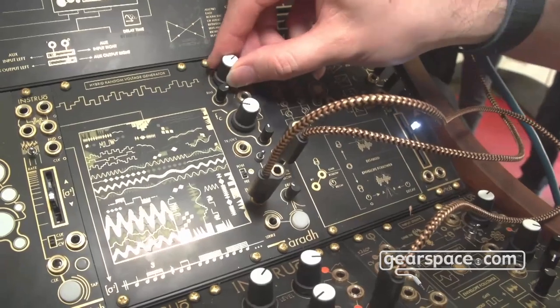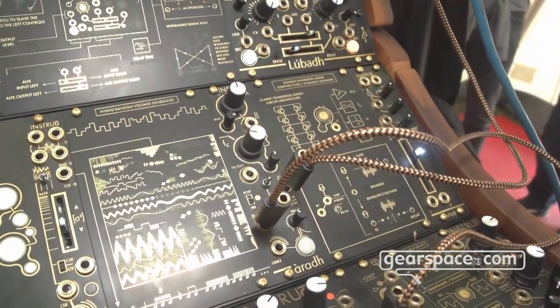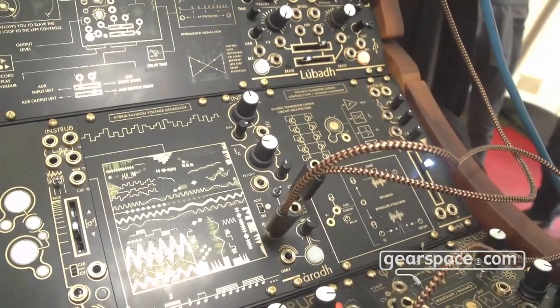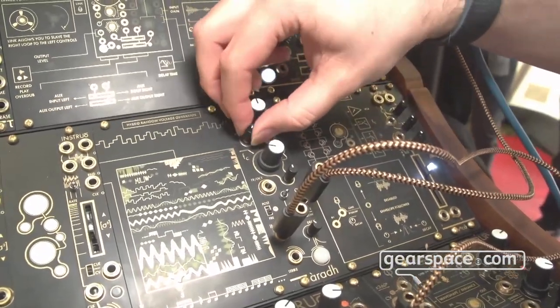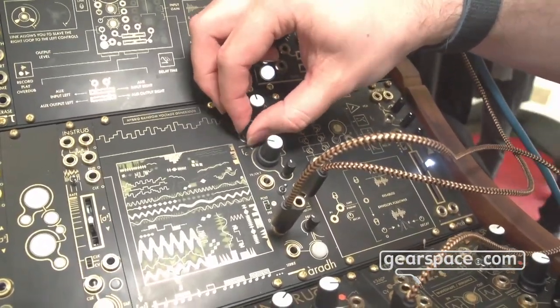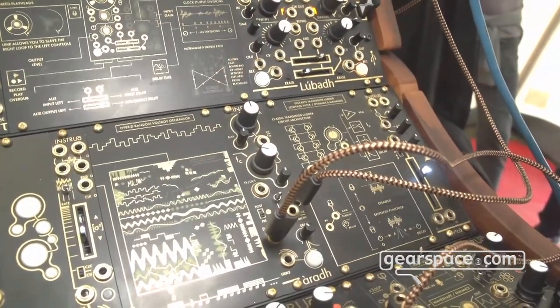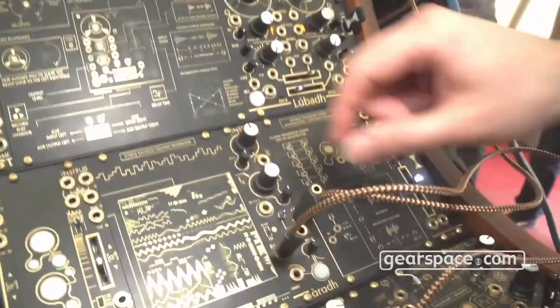Routing CV to filter cutoff and VCA gives you the ability to change modulation depth — you could be modulating loudness from the VCA post-filter for more static filter shapes, or modulate both simultaneously. If you go with both, you can add a degree of bias to the VCA, especially if it's set pre, which will saturate and drive into the filter a little bit more.